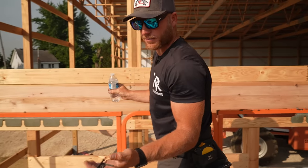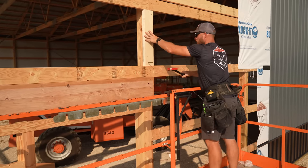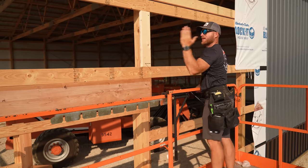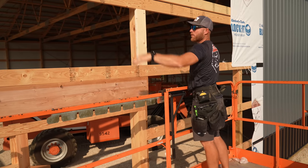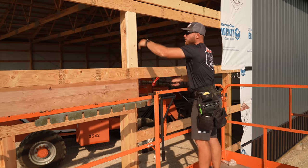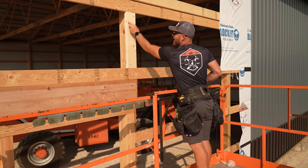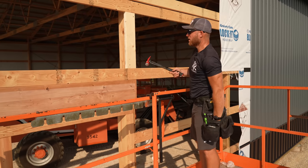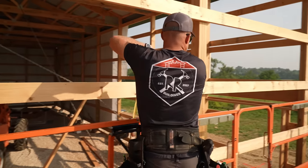I feel like I officially became an old man when I brought a spare coffee can of nails that I found in my shop because I was out of 20-pennies. What we've got to do here is add some blocking, because this is where our porch trusses are gonna land on the wall. Since we're gonna have house wrap over this whole thing, normally you could attach them directly to your post, but this gives me a nice place to land my two-by and then have a bracket holding it onto the wall.